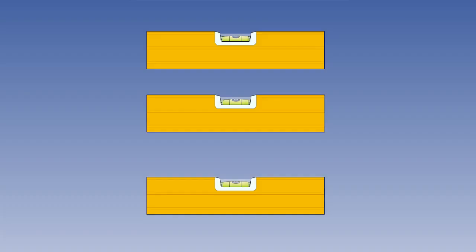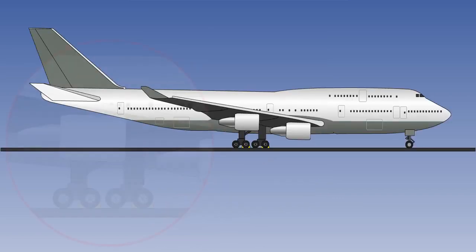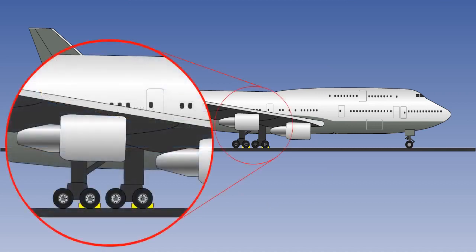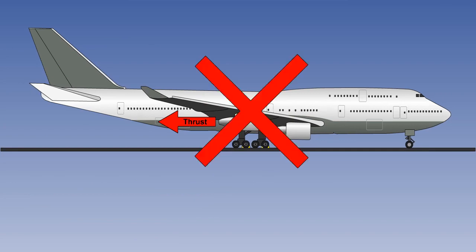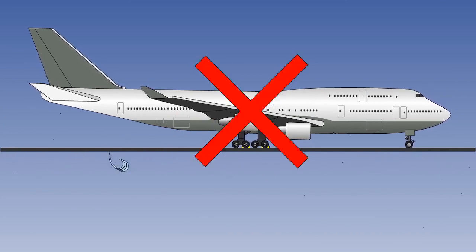We said earlier that if you move accelerometers sideways, you can't use them for measuring the vertical. Therefore, the aircraft cannot be moved at all during the alignment process. The slightest movement off chocks will destroy the alignment and you will have to start again. With many aircraft, it is not possible to align with engines running. Even gusty wind conditions can prevent alignment.